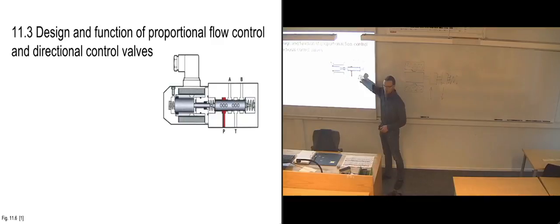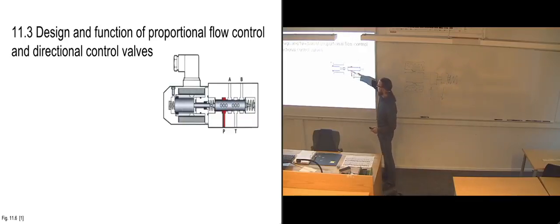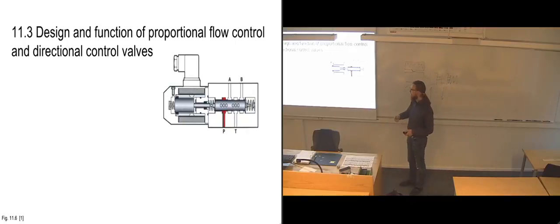When you were running full pressure and you had actually closed your valve, there were holes drilled into the slide, through the slide, and then out where the return to tank was, so that you would have full recirculation, even though the slide itself was closed, so that it was blocking off flow from the pressure port to any of the others. There was a canal going through the middle of the slide and over to the tank port, so that you had full circulation, so that you didn't have any resistance for your pump when you had it closed.